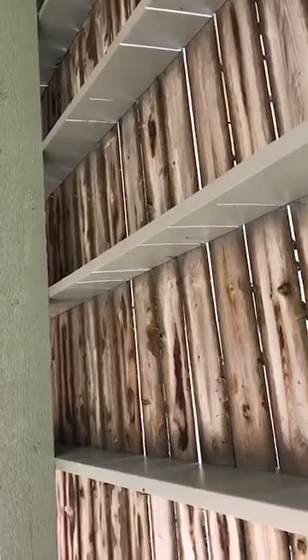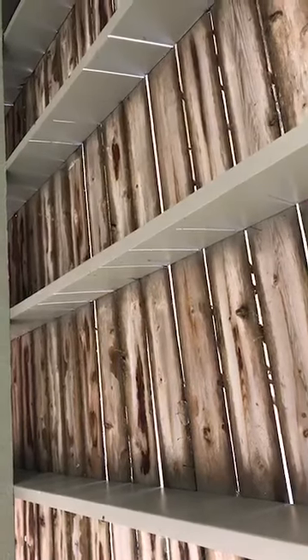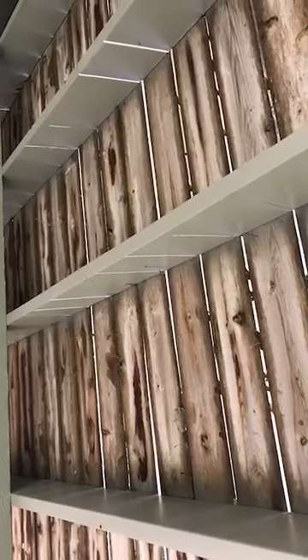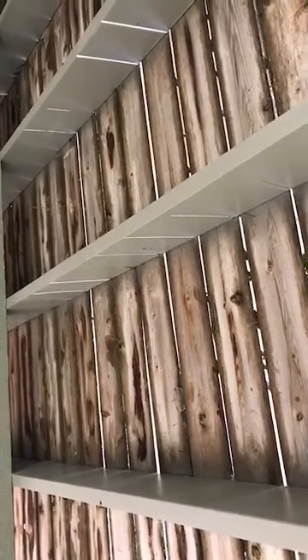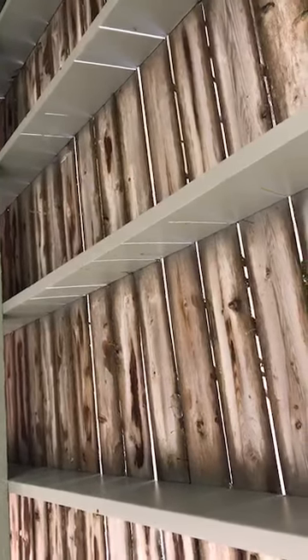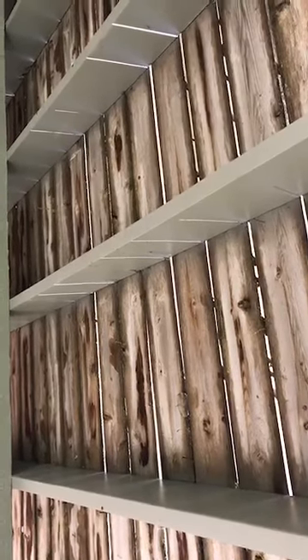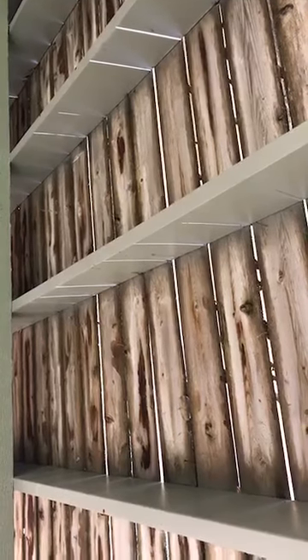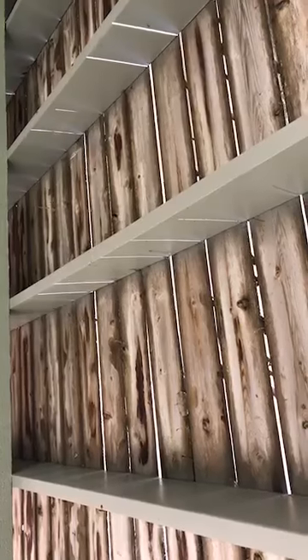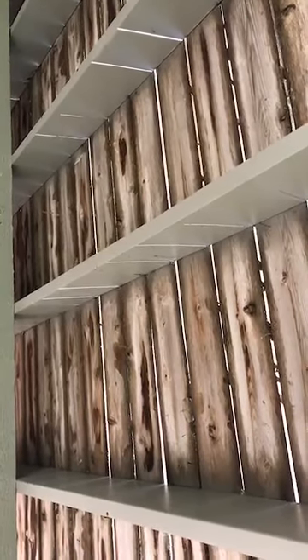Now it could be that that can be worked with the proper decking on top. But the decking that's on top is the standard 5-quarter, which is inch-and-a-quarter thick decking, which is designed for 16-inch on-center joist spacing. With 24-inch on-center joist spacing, we should go to true lumber, which would be inch-and-a-half thick — two-by material — to get the additional strength for the extra width of the joists.